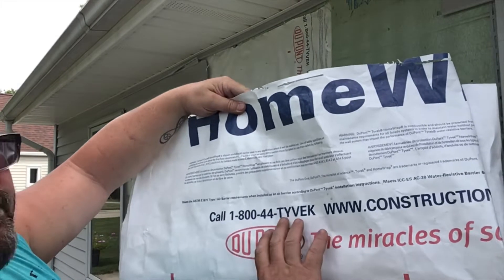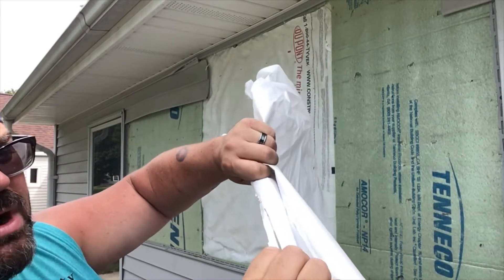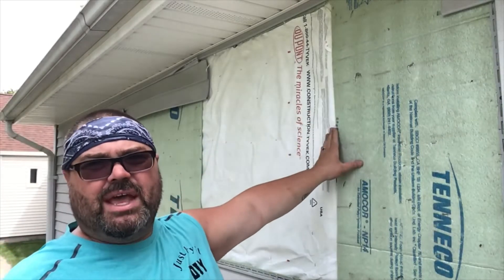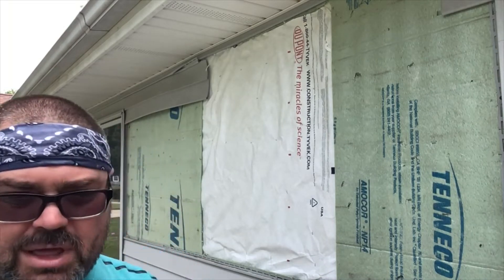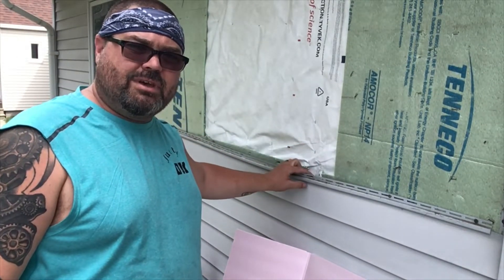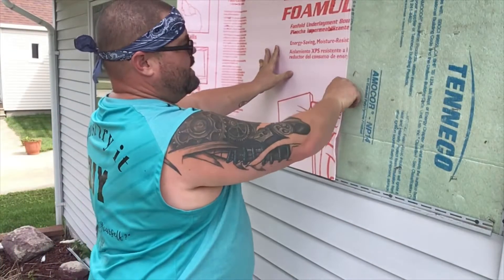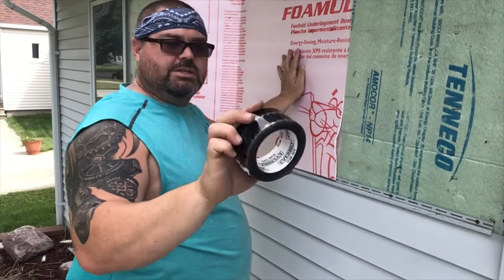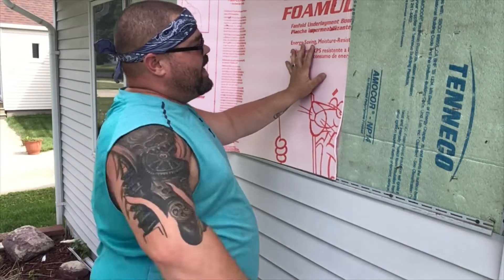Tyvek, what I was talking about here, is a house wrap. It's a very durable, almost kind of a plastic and paper wrap material. It helps, not necessarily insulate the home, but helps seal the home up a little better. As we put the insulation on the outside, we're going to put tape across these seams. Down at the bottom you can see where the old joint was - you can see that tape inside there. So what we're going to do is put in some new foam board insulation that'll fit right inside here, then place seam tape right over the top and seal that off, get it all stapled in place, then put the siding over the top. Here's the seam tape we're using - it goes across and tapes all those joints back up so we don't have an air gap in the middle.